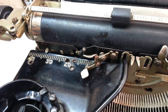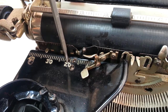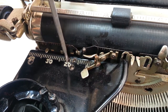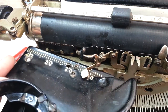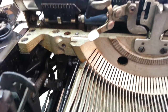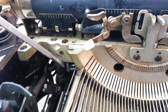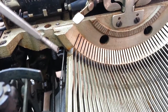So if you were to stick your screwdriver down in here, you could feel the slot and you can turn this — that tightens or loosens, not the draw band, but the mainspring which is connected to the draw band. So I've got this cover loose so we can see what we're doing down here. That screw right there turns that spindle, which is connected to the draw band or the mainspring core right there.